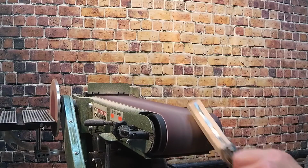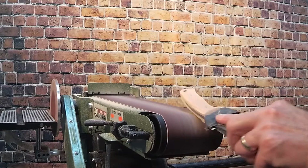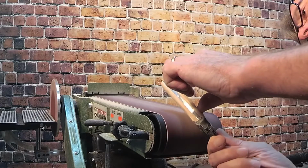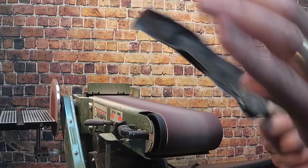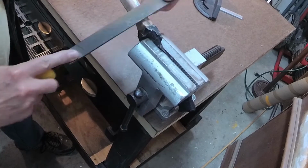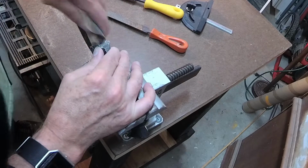Once again, you could do this same thing using a wood rasp and then files to bring it down, and it would just take a little longer, but if you have something like this, or even just a regular belt sander, you could turn that upside down and do it as well. But this worked really well, and was able to get 90% of all the smoothing and shaping that I could with this. Now, anything I couldn't quite reach that was getting close to the blade or to the thumb handle on that, I came back and used a rasp and then files to bring that material down. But you could actually smooth it down that way too.